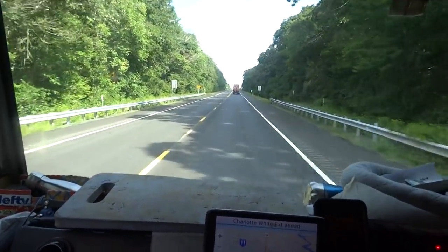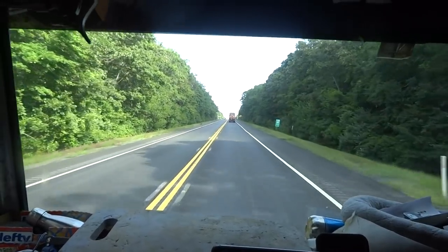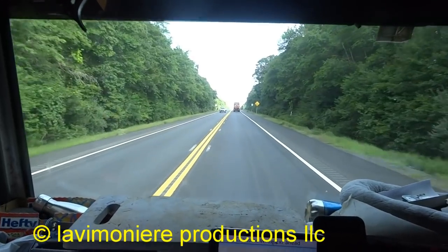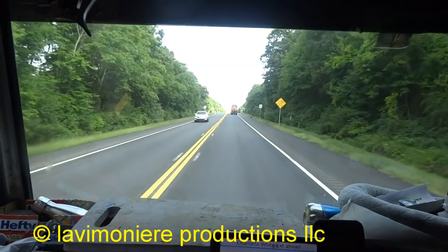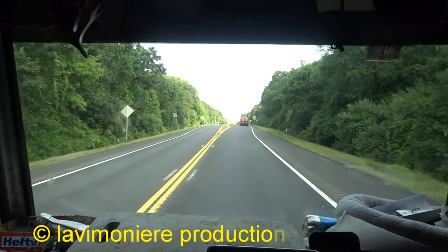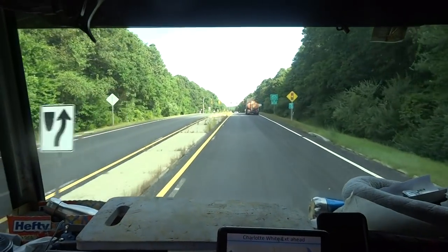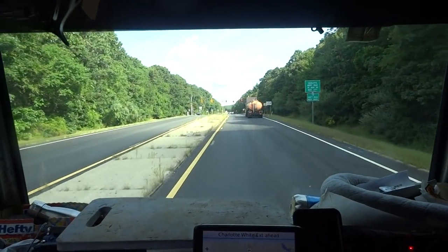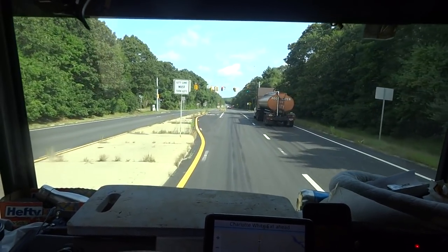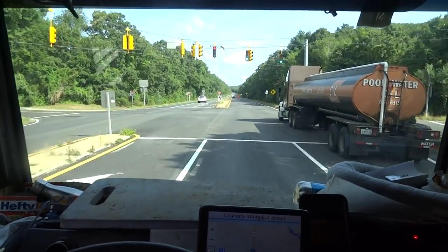Morning, guys. September 10th, 2019. This one here, I gotta go hook up a conversion burner, a gas conversion burner. This house has got two oil tanks, and they put a gas line in there and are pretty much out of oil, pretty close to being out of oil. And I had a used conversion burner. We're going to hook that up for them. So I want to kind of prep it, get it all set, ready to go. And I want to use up all the oil out of the tanks before I convert it over completely.